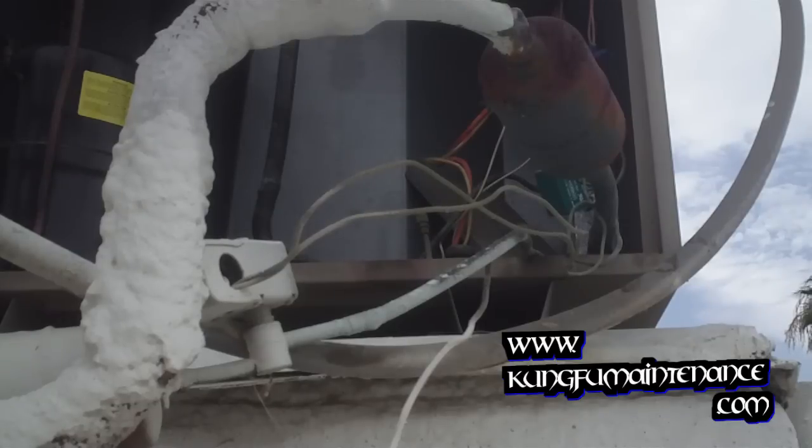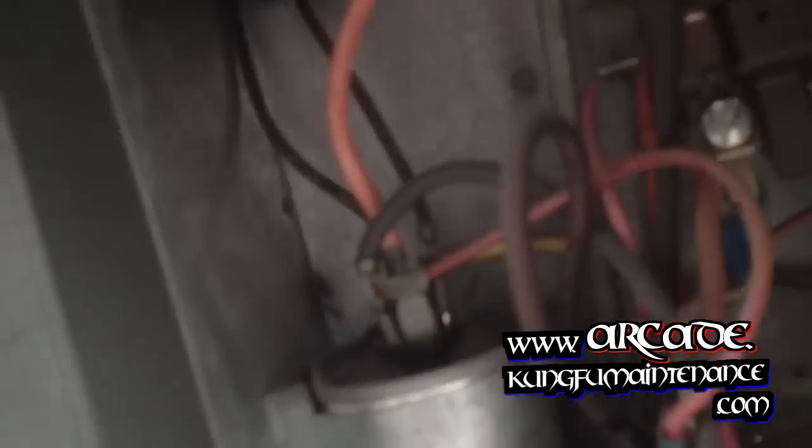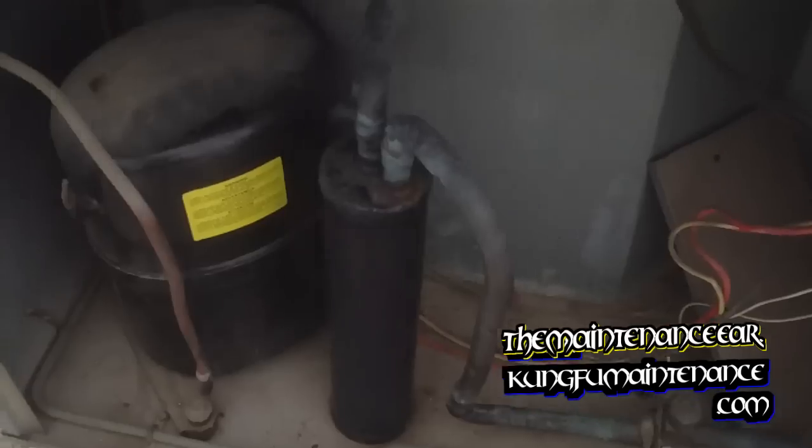It's actually a little bit cooler today, a little overcast. Contactor sucked in. Compressor's not too hot. It's got an original contactor. It's like it's still alive. Hard to say. Maybe just move the fuses, check the wiring, and go ahead and pull the disconnect.